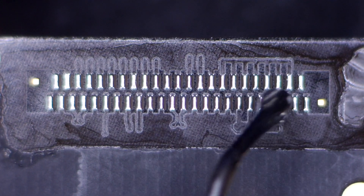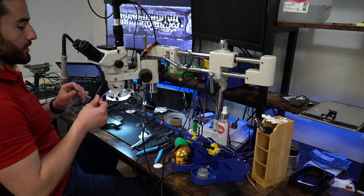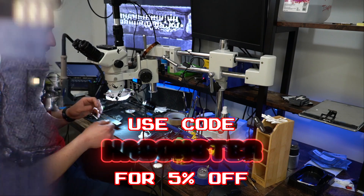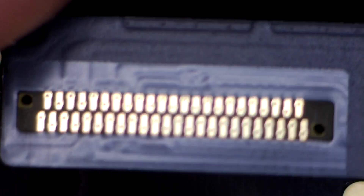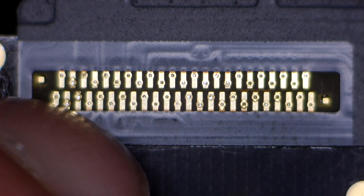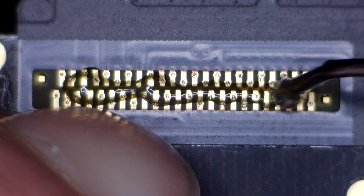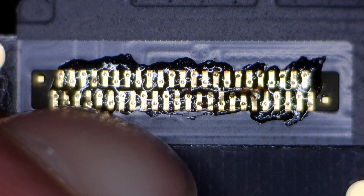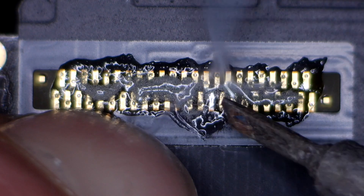Then I'm going to put down a little bit more flux, make sure it's covering the pads entirely. I'll grab my new charging port — I got this from Wholesale Gadget Parts, I'll leave the link in the description. Make sure to use code KABOSTER for 5% off. Then I'll line up — right here you have two gold squares on either side. I'm going to line those up with the holes on either side. Make sure it's nice and even. As long as those gold squares are in the circle, you're good. I like to add some more flux — we're going to make a flux sandwich here. I'm going to put down some more low melt solder and we'll grab our soldering iron and solder this down.